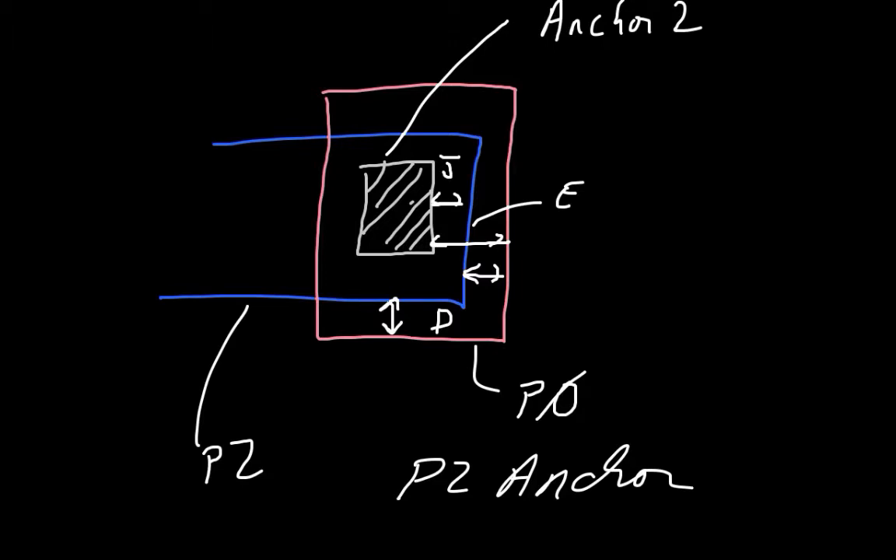Also the overlap between the poly two and the anchor — this distance has got to be at least four. And then you have to have at least this much distance between the edge of the poly two to the edge of the poly zero, which I think is five. So if you add it up — four plus five is nine. So why do we have this design rule here? It's because we can't have the anchor so close to the poly edge. And sometimes you'll have the poly two continuing on and you won't have to worry about this rule. And again, as a student pointed out, you want to keep that enclosure design rule the same on all three sides of this — not just this edge, but all of these have to be enclosed properly.